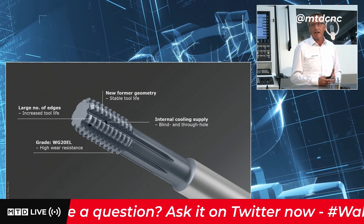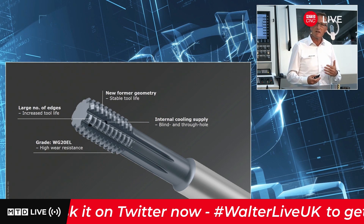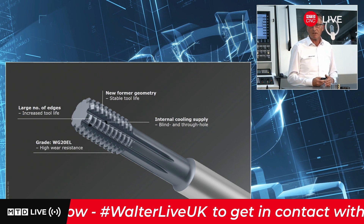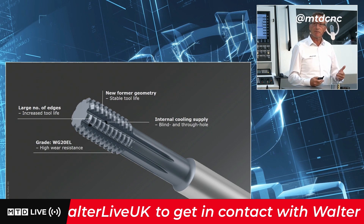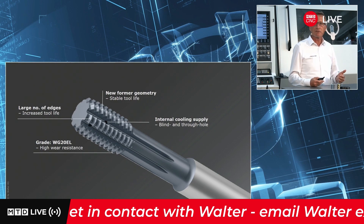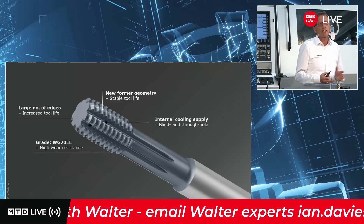The high PIMS coating is extremely hard and very smooth. This prevents material adhesion — what we call welding — which would impact thread quality and require the Threadformer to be replaced early.